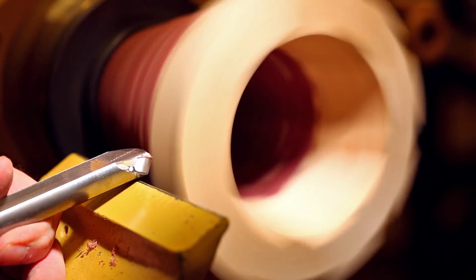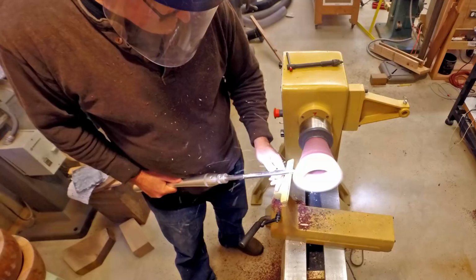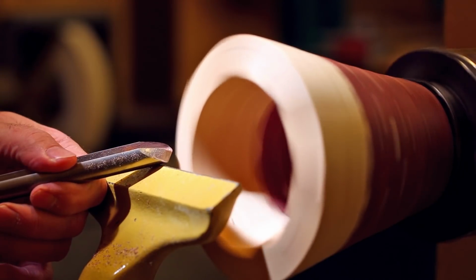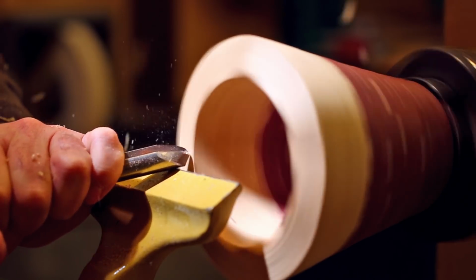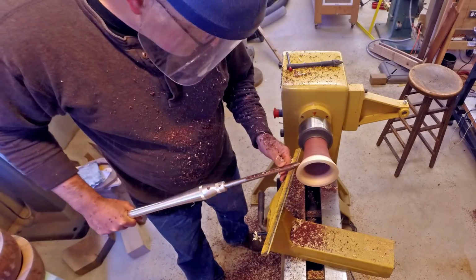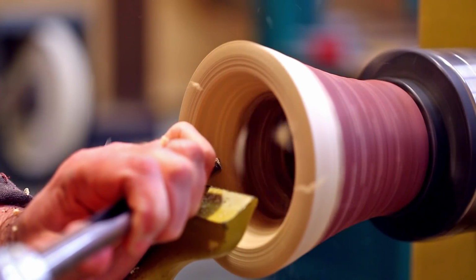And I'll do most of the work at the bottom end of the bell when it's set up like this. I found the birch was a lot easier to turn than the Purple Heart, so I can get the basic shape going at this point. And then clean up the end. And there was actually still too much of the birch at the bottom, so I shortened up the bottom of the bell. It's sort of tricky through here because I sort of knew in my mind the shape and how I wanted it to work, but each step doesn't get you the full way there, so you have to kind of guess the form that you're making. Like I wasn't exactly sure how much of the birch to take off, but it kind of felt about right.